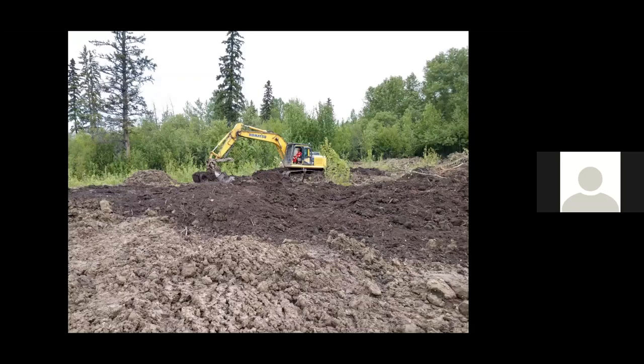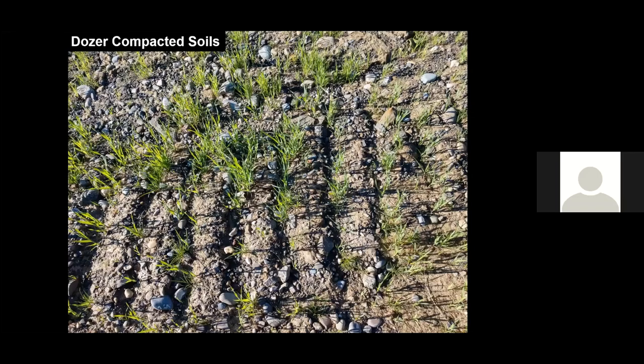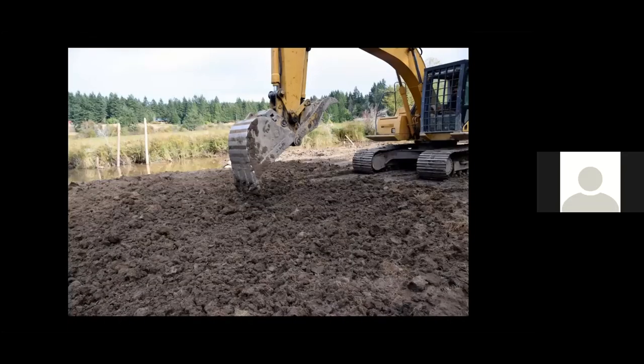It takes time to spread the soil removed from building a wetland using the groundwater technique. When spreading soil within and around a wetland area, I do not recommend compacting the soil. What you're looking at is soil compacted using a dozer — a standard construction technique I don't recommend because plants are slow to grow on compacted soil and the site is more likely to wash and erode if compacted. If you spread grass seed on compacted soil, you're lucky if the seed comes up in the cleats of the dozer tracks, and when there is rain, the site is likely to erode.